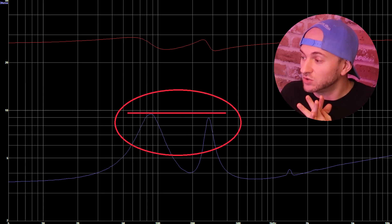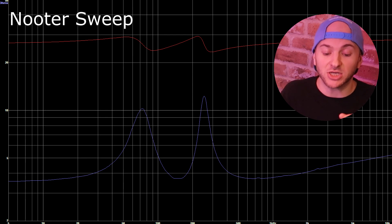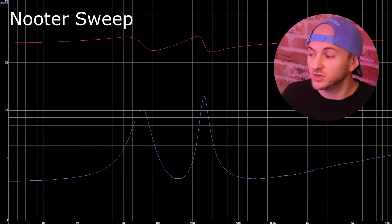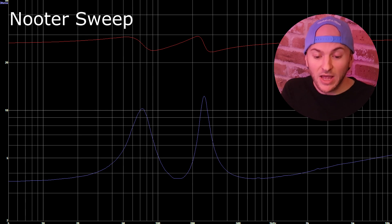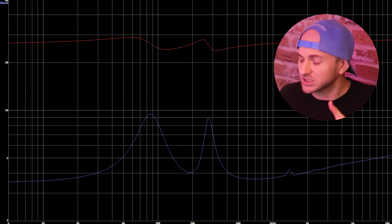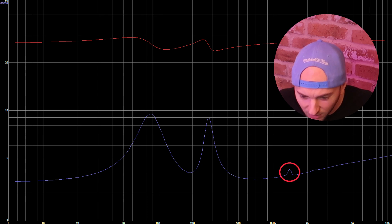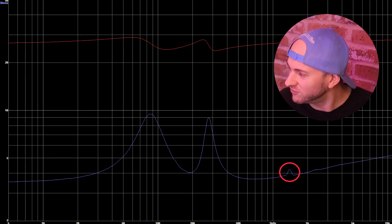It's also a bit in contrast to the Neuter Shooter, which was a very small enclosure where the secondary spike was much higher than the initial spike, showing that the air spring had a great effect on the woofer, and even when the woofer was fully unloaded and the port was fully unloaded there were still some pressures inside, just because it was so small. This looks like a fairly well-balanced enclosure in terms of the enclosure size and how the port is interacting with the driver. I'm still super curious about that little peak up near 1.391 kHz though — is that another Helmholtz mode? Is it some kind of quarter-wave mode?